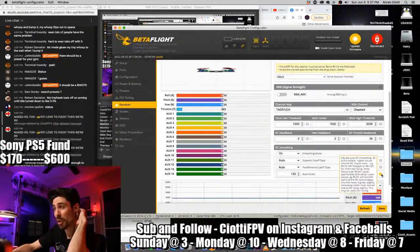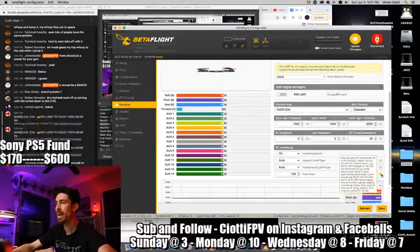Adjust RC smoothing. 30 is the default. Yeah, I thought 30 was the default. 130 is really high. 60 for HD freestyle, 90 to 120 for cinematic flying. So this is a pretty cinematic-y number. It says note values over 50 will cause appreciable stick delay. Yeah, I usually run this at like 30.